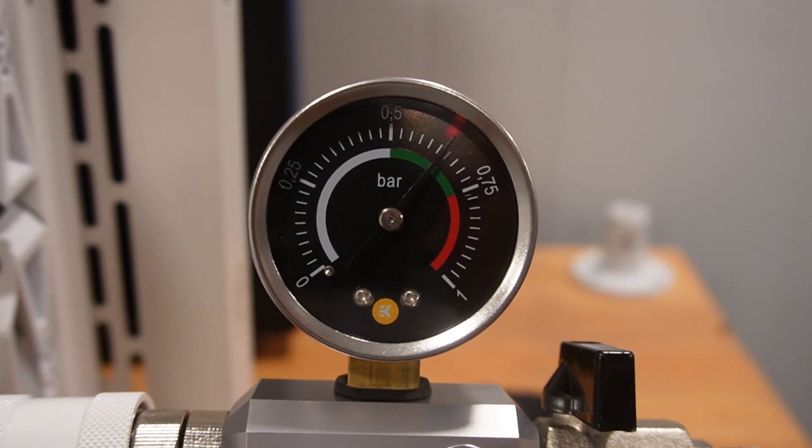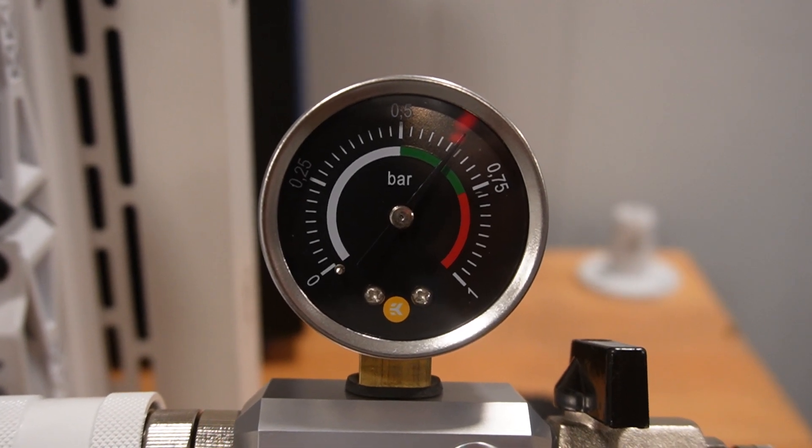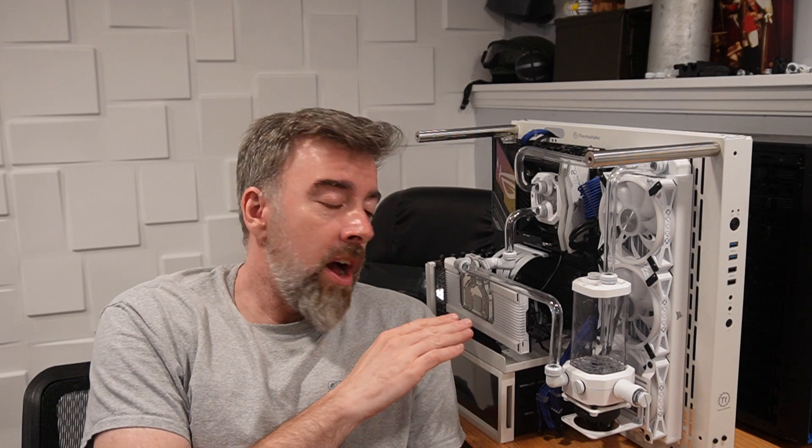Alright guys, it's been about 15 minutes now. This needle's in the same exact spot, so we're good to go with the pressure. There you have it — completely pressure tested. 15 minutes, no loss of air at all. And air molecules are small and wild molecules, so we shouldn't have an issue with water. We are going to leak test it though, and that's the next video. But for now, we're done guys.